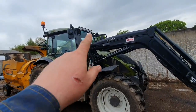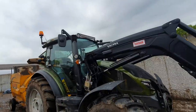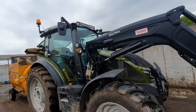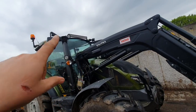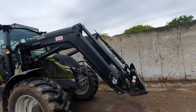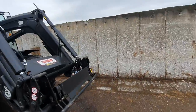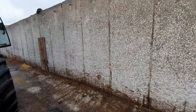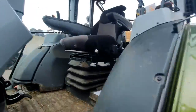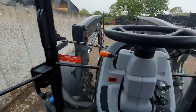The light bar up there is not part of the standard equipment — that's what we started on the 'pimp my tractor.' It went quite well actually. This one, quite weirdly, hasn't got the high-level headlights even though it's got the loader, but there are plugs up in the top of the cab, so I've literally just pinned it into the high beam. Works a treat.